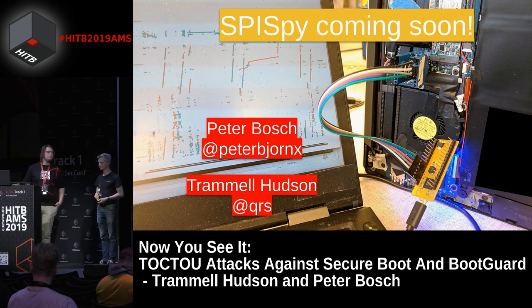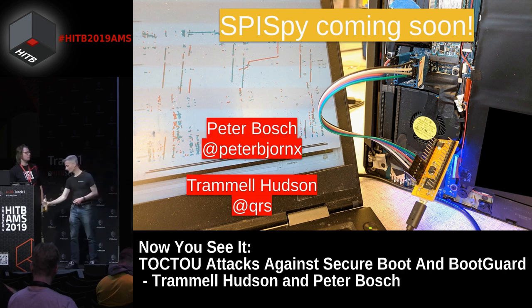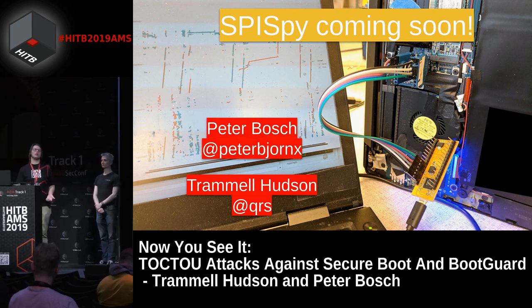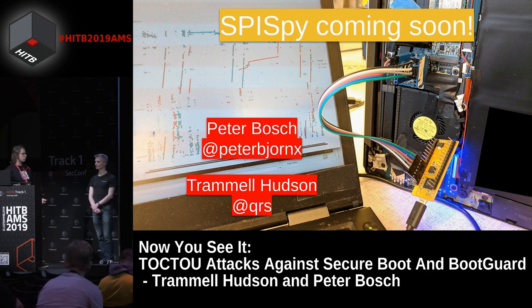Well, that's a yes and a no, because in terms of this having happened to your system, at the moment you can't see it from a software side because the code hides itself again after being run. And if someone would have made the device that I described that would fit inside the footprint of one of these chips and camouflage it as a chip and install it in your machine at some point, I think nothing short of an X-ray of the machine would really point that out. But on the other hand, you can at least detect your system being vulnerable, even if it's already being exploited, by using this device and looking for the access patterns.